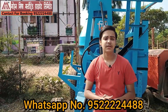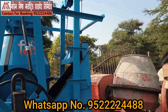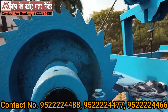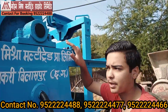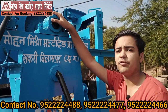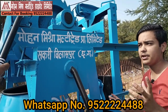Last but not the least, the processor of this machinery — just as the processor works in mobiles, the shaft works in this machinery. All the main basic functions happen in the shaft. As you can see, the shaft carries all the weight of the machinery and all the heavy tools required for lifting are fixed here — including gears and the rope used for lifting. Other companies in the market use a 48mm shaft, but we use a 60mm shaft, which gives you a greater capacity. All the basic heavy equipment is fixed in the shaft, so you can understand the importance of having a bigger shaft.